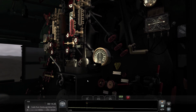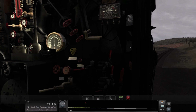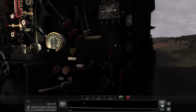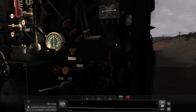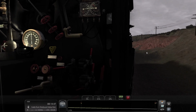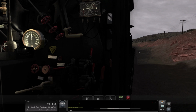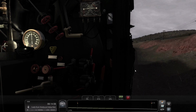You'd prefer for the fireman to use the exhaust so you're not burning all the way through your live steam on such a big engine. Because you burn through water, to fill the engine with good steam and waste it using water, it's not good. Steam that's already been exhausted to the cylinders and can heat the water going in is better thermodynamics, and it's already used steam.